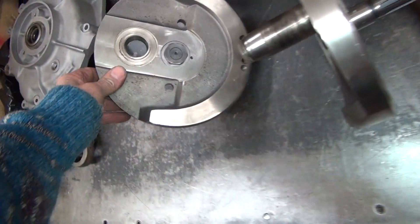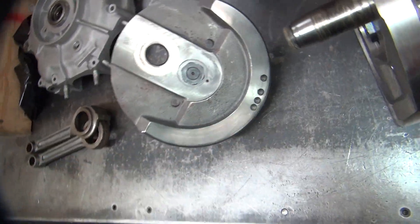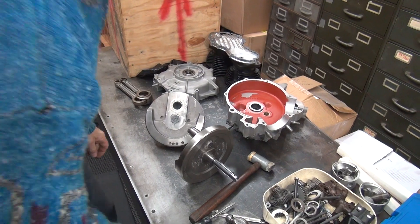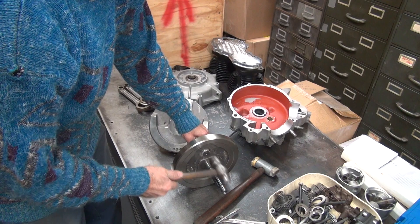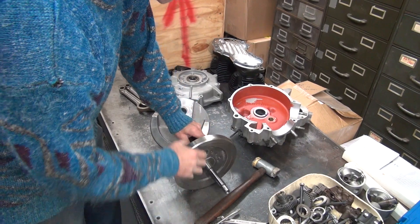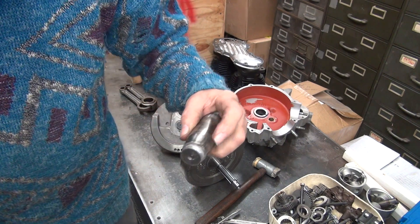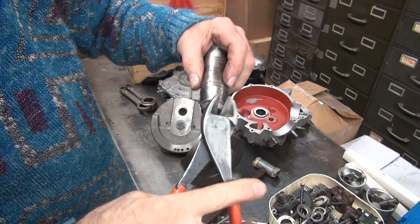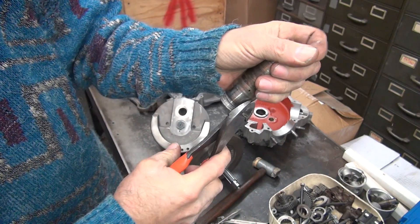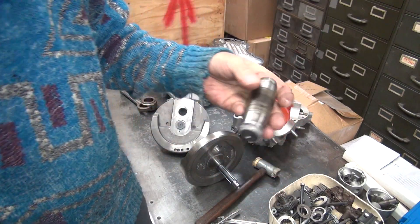So that's pretty torn up. Pretty small holes for lightening — balance in. Now use a steel hammer to pop the crank pin, but hit it flat. If you don't hit it flat, it screws up the thread. If you want to keep that key, we need that. Take the channel locks — your dykes — grab a hold of it and just lift up on it like that. Leverage it up and you get the key out. That we need. This is junk.